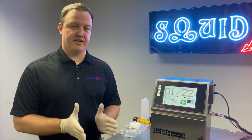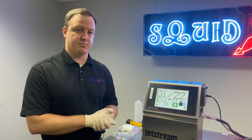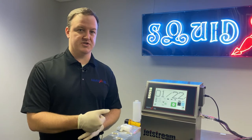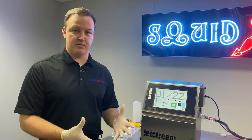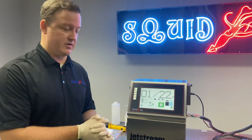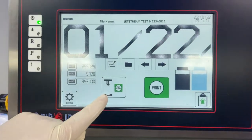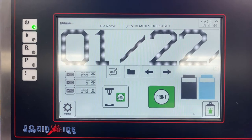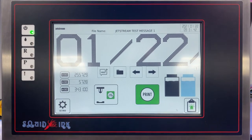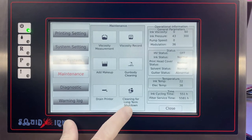For any of the three scenarios in which we would use cleaning for long-term shutdown, you start off the exact same way. Whether you're changing ink types, doing a PM kit, or prepping the machine for long-term storage, we're going to start off using the exact same steps. First, make sure the printer is not jetting — we do not want the hydraulics running. You should see on the display that the system is not actively jetting, but power is on. We do need power on to utilize this process. Once we've verified we're not jetting, go to the settings page, then maintenance, and locate cleaning for long-term shutdown.